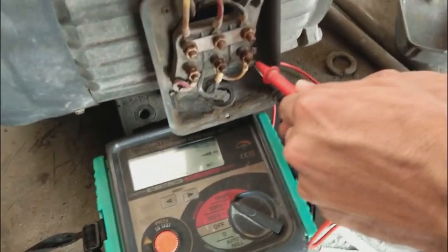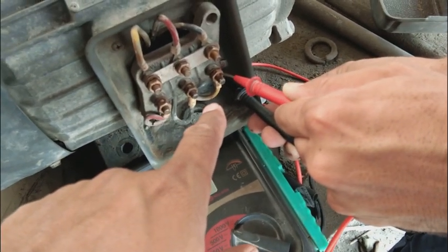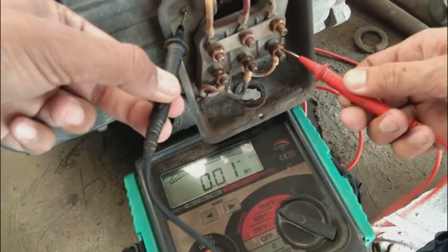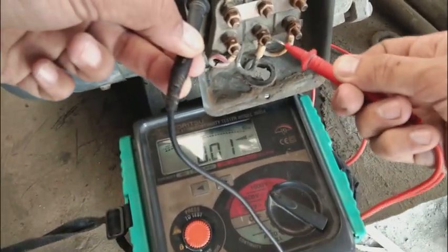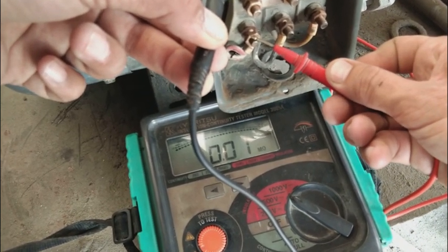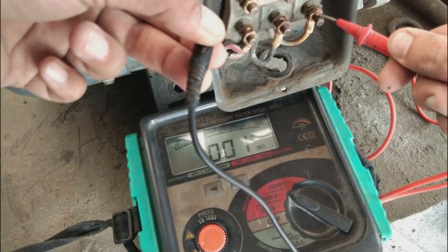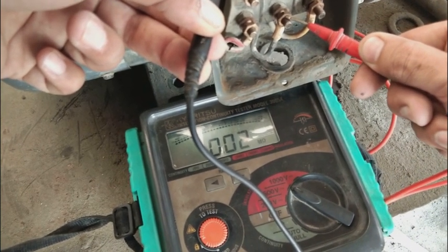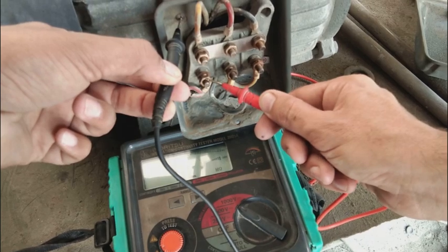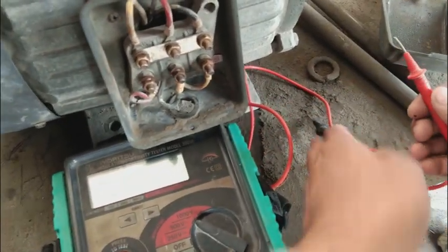We will test the motor winding with the body. As you can see, it is showing zero resistance. I am connecting here so that you can see easily how we are checking — we are taking resistance between these terminals and the motor body. This resistance should be high resistance, either out of limits (OL) or very high, and should not be zero. In this case it is showing zero mega-ohm, which means that the motor has failed — the insulation in the motor has broken down.